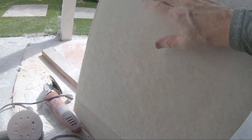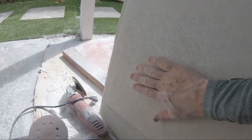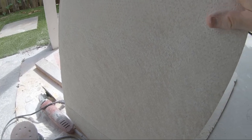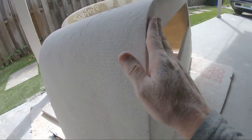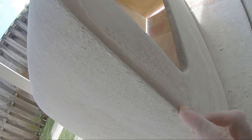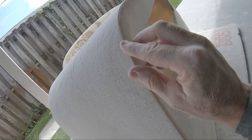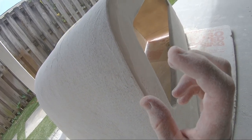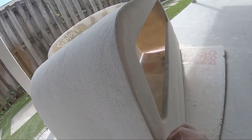There are some high spots here so I hit it with the flap disc first to take off about a sixteenth of an inch, then came back with the DA sander to get it perfectly flat and smooth. I have nice 90-degree edges here. I'm thinking I'll put a small radius on this with the router so there's not a sharp edge — a sharp edge could crack the paint or gel coat if it gets hit.